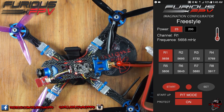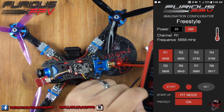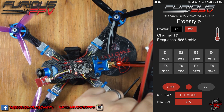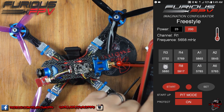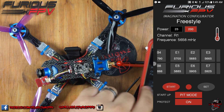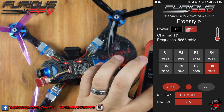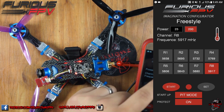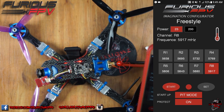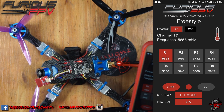Let's go back to freestyle. If you want to go to freestyle, you have the selection to choose 25 milliwatt or 200 milliwatt. If you wanted to set 200 and then change it to say R8, A1, B1, or E1, whatever it is, you can scroll through all your frequencies and it will scroll back around — from R to A, B, E, F and then back up to R. So if you wanted to set R8 at 25 milliwatt or 200 milliwatt, you'd hit set. We're going to go ahead and change it back to 25 just to make sure. Hit set and it is set back to R1 at 25 milliwatt.